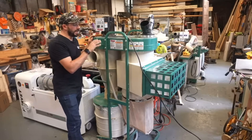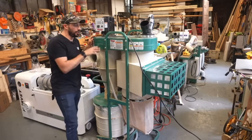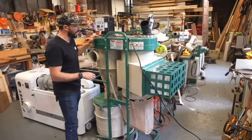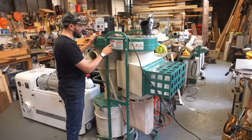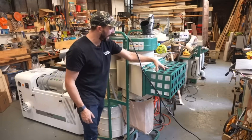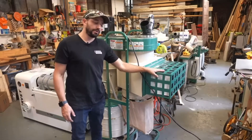Over at the cyclone, this is a Grizzly G0703 HEPA. They don't make this exact model anymore, but I'll put a link below to a very similar model for about $2,000. This is a one and a half horsepower unit that will run off 110 or 220 and claims 775 CFM. It's a HEPA dust collector based on this filter system here on the back, so any fine particles that don't fall into the bin or bag should be filtered at a HEPA level.